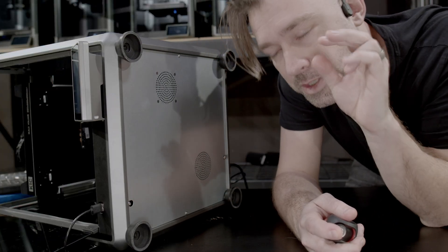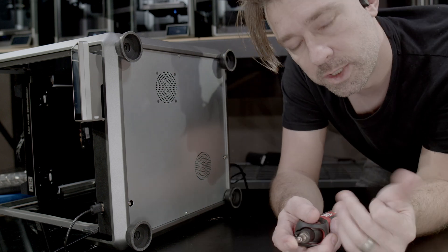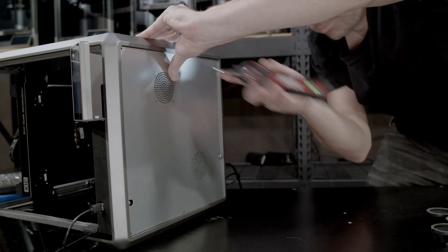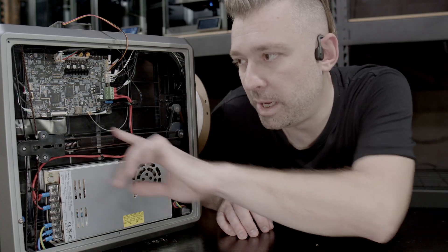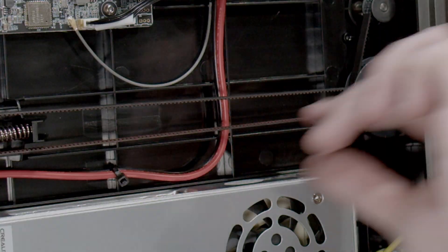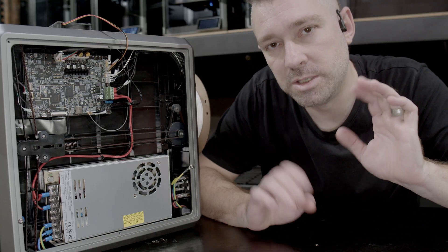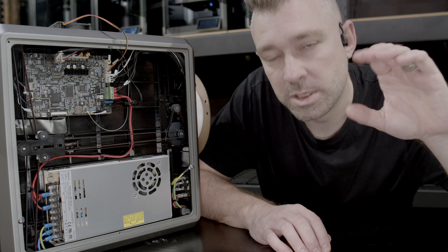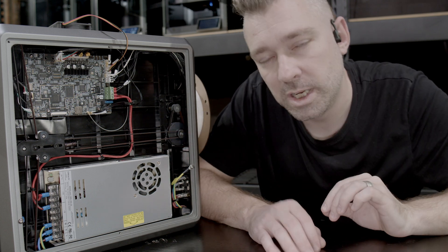The K1 series machine has six screws for the bottom cover — there's four inside the feet and there's two, one here and one here. We'll go ahead and back those out so we can access the bottom of the machine. Now that we've removed the bottom cover, we can see the belt here that is driving the three Z screws. The way the Z screws actually align is they're indexed into the teeth on the belt. If they're not indexed correctly, then we have alignment issues — it's not the bed itself and not exactly the Z screws, but the way the belt indexes with the bottom of the Z screws.